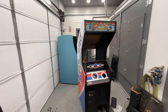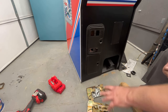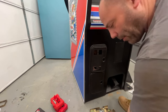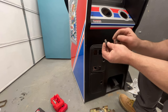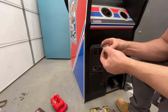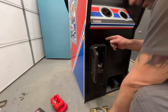Let me grab some of the internal parts for the coin door — I just wiped them down, they're all in good shape. I don't want to wire wheel them because that's going to take the gold coating off and they are in pretty nice shape, so we're going to leave them as is. I have the bulbs here — one's got a 555 and one's got a 194. A 194 bulb is a 12 volt bulb and I'm not sure the 555 is. I did find the other spring, so I have a set of springs for the coin return buttons and the new coin return buttons. We're leaving the free play button. I did order a Dallas RAM for the circuit board so it'll keep the high score.